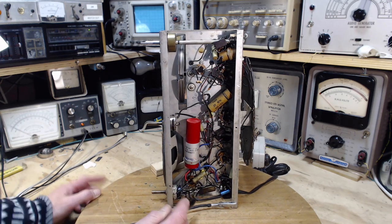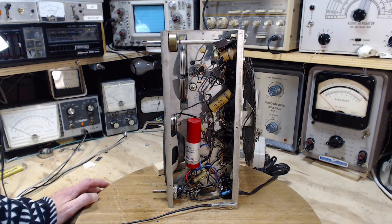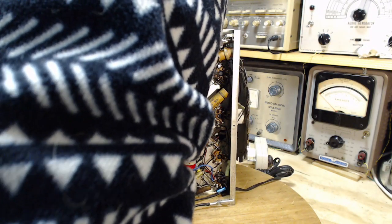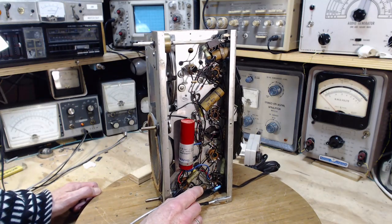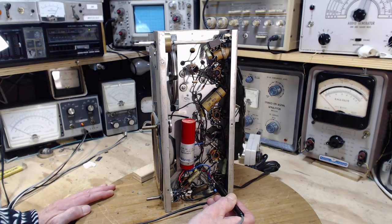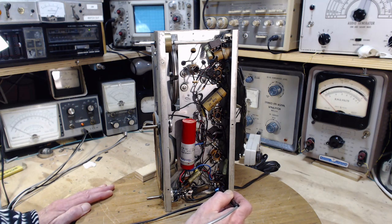So we'll probably find the 100 volts on the output tube. The output tube, I just want to look to be sure. Output tube is this guy with what I believe is this capacitor, and this is almost certainly the plate right here, and we should see that's the 80 volts. I kind of thought we might see the 100 here. Let's go here. Okay, nothing, something.